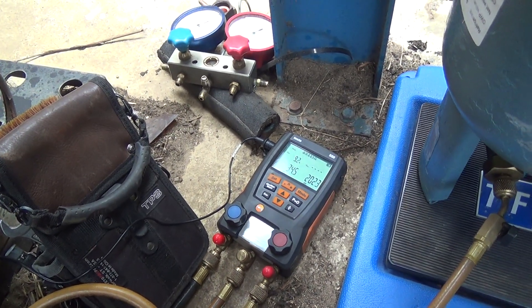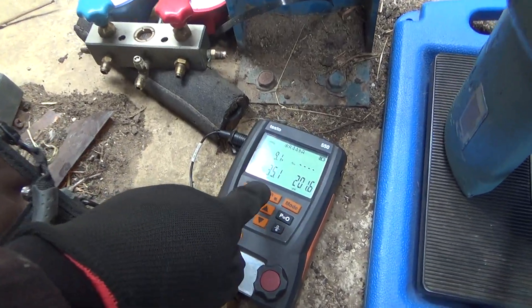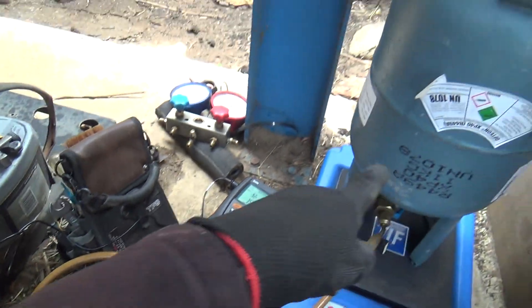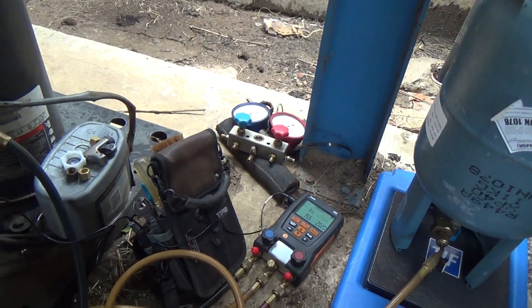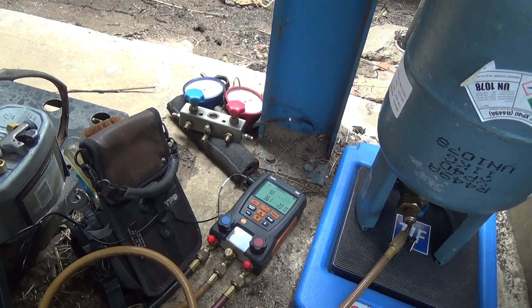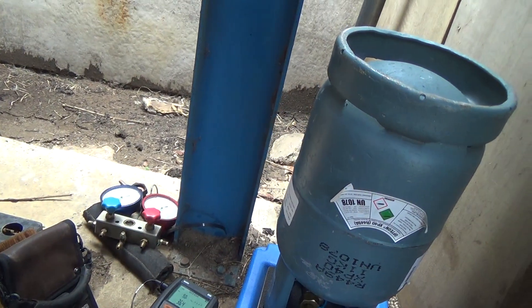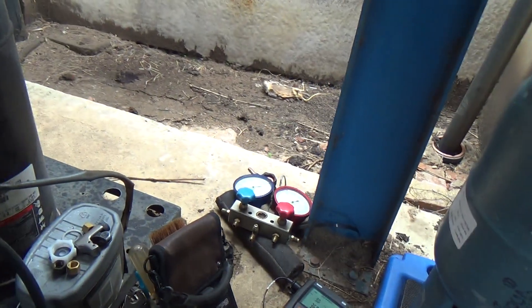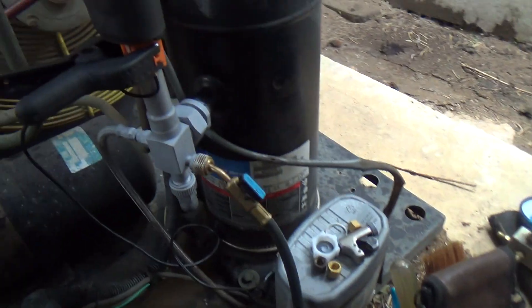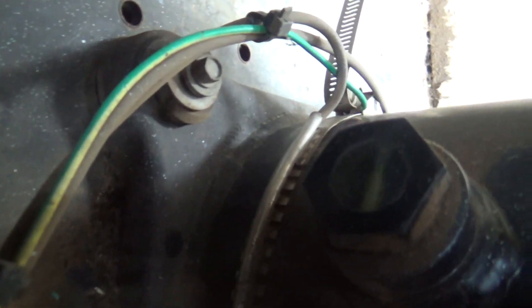Right, that's that running. The suction pressure is very low. I find a lot of these new refrigerants don't work as well in these tanks as R22 used to. You'd probably want the evaporator redesigning to cope with the glide or something like that. Anyway, that's all we can do - work with what you've got.